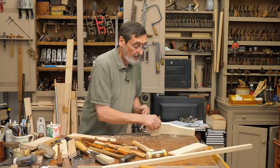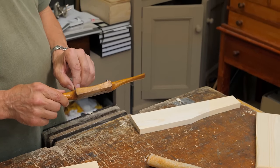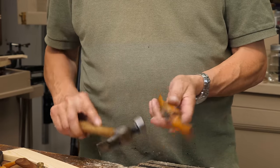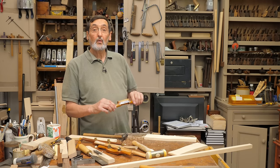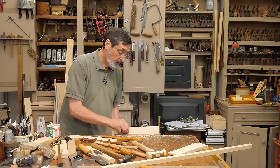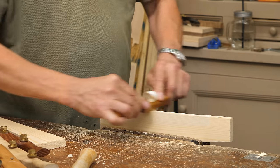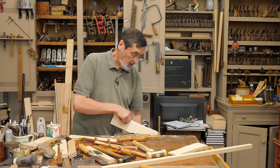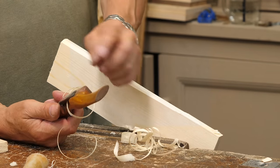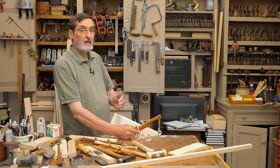You can micro-adjust these so simply. You might think you have to have a mechanical adjuster, but not necessarily. This spokeshave here is one of the earliest types — it's got two tangs protruding through the body, with the blade here. You align it like a plane — you tap this end, tap that end — and eyeball through from one side to check if it's even. But most of these spokeshaves were actually used in an uneven state. So you tap one end to get a heavy cut on one side and a very light pass on the other. That gives you infinite variability — heavy set one side, shallow set the other — all the way from heavy to very fine.